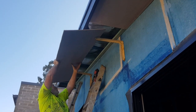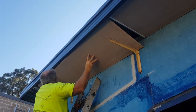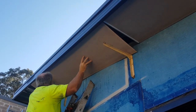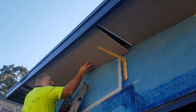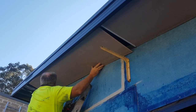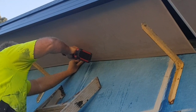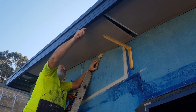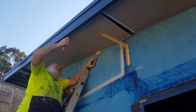The shelving brackets are positioned in such a way that they angle it up into that groove. Once I've got it set in place I'm just putting some temporary screws that are below the edge of the board, just to hold it in place so that I can slide it into that joining piece. From there, once it's joined up, I can put the screws in permanently and remove those bracket supports and move on to the next section.